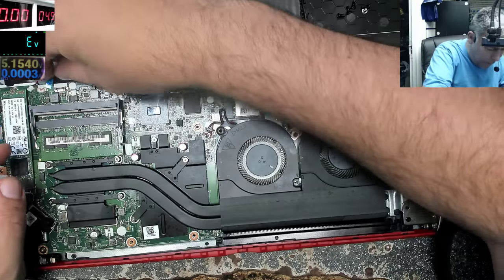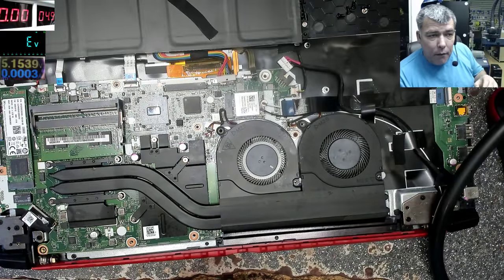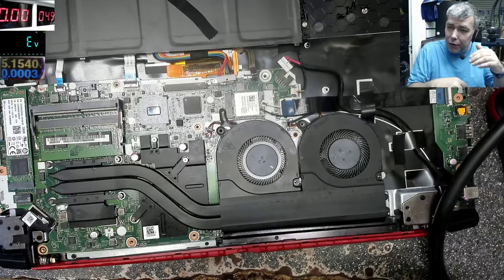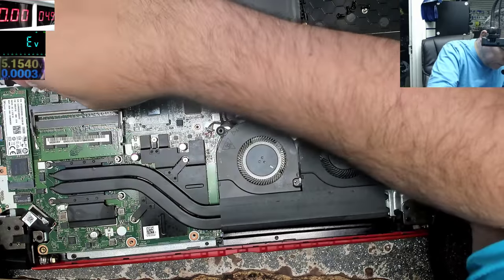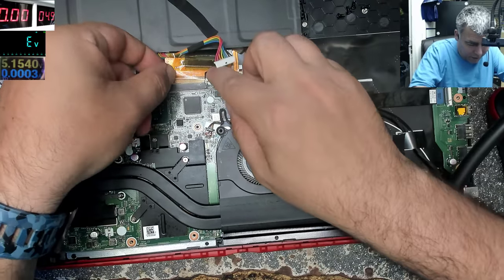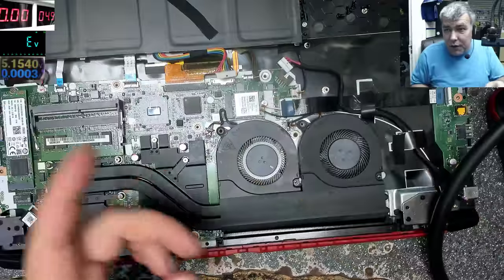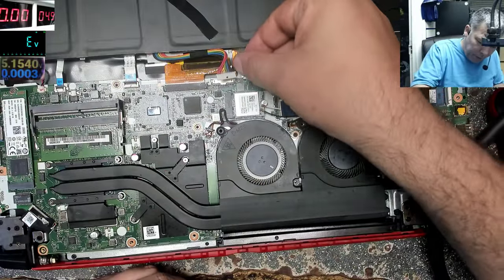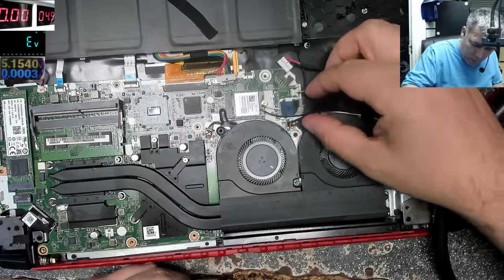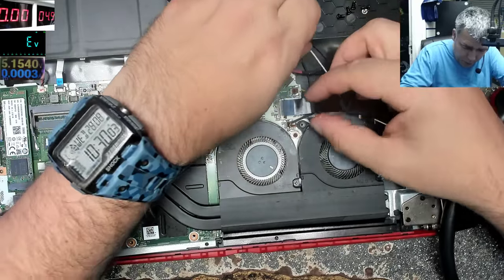It's a multilayer capacitor. From the manufacturer's point of view, it's quite hard to make a high-capacity capacitor at small size. To make high-capacity capacitors go smaller, the voltage rating goes down. It's hard to make a small capacitor that's also good — you have to make it bigger. If you make the capacitor bigger it will be fine; the short-circuit voltage will be higher and it probably won't die. But everything is going smaller these days, so I suppose it's impossible for manufacturers to make bigger caps.